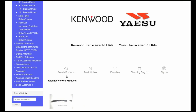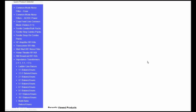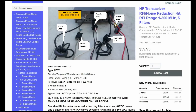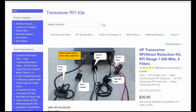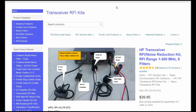They've also got kits for various transceivers. Here's the back end of a Yaesu transceiver. Each of these cables going into this transceiver can act like an antenna and literally receive RF, and put it into the transceiver in a place where you don't want it. So you can't just buy a ferrite bead and think that it's going to work — there are various mixes, and they work at different frequencies, and you want to make sure you get the right one.